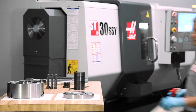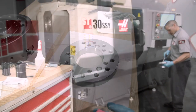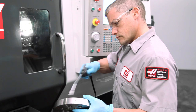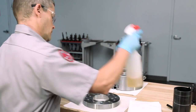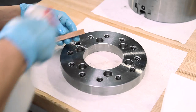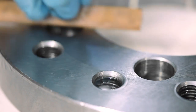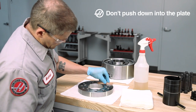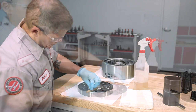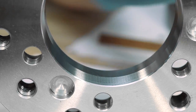At the workbench, Andrew cleans both faces of the adapter plate — WD-40 works well to cut the grease — and blows out any chips or debris stuck in the screw holes. Then check for dings or high spots on both faces using a fine-grit deburring stone. Spray a few shots of WD-40 on the face and lightly draw the stone across it, feeling for a change in drag to indicate a ding or high spot. Don't push down — you're not trying to remove material from the entire surface, just any high spots that might be present. Rub the tapered bore to check for damage there as well, and carefully remove any nicks found.